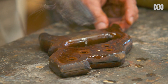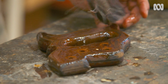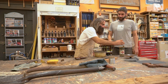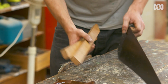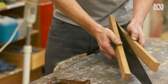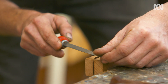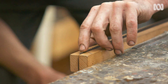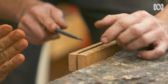Just lather the oil on — let it soak because we want it to penetrate into the timber as deep as we can. Now we can sharpen the blade. First we need to clamp the saw — we're going to use two bits of timber and clamp them around the saw. Then run the file through the gaps in the teeth to sharpen up that side. Look at that beautiful chrome — it's shiny!